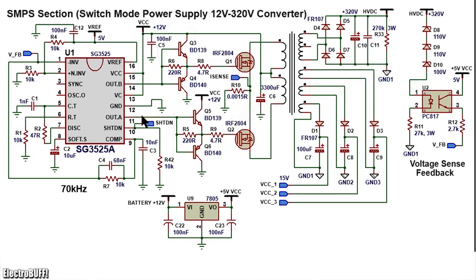Let's say in the first case you have a high output at pin 11 and a low output at pin 14. Q4 will turn on and pull down the gate of the MOSFET Q1 to ground, forcing it to remain off. Q3 remains off because it's NPN. Q5 now turns on because its base is pulled up to about VCC, but Q6 remains off.